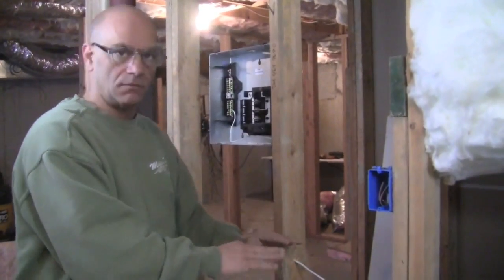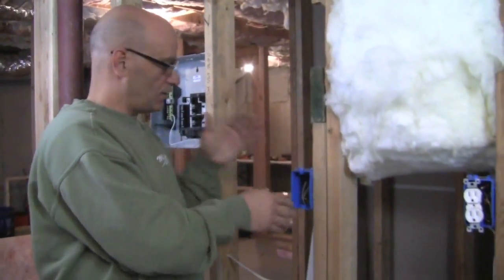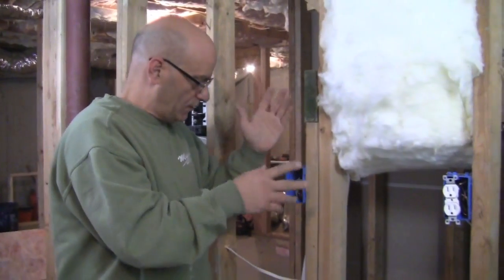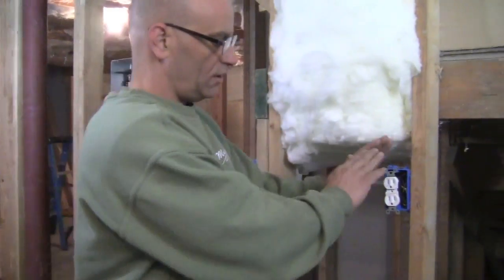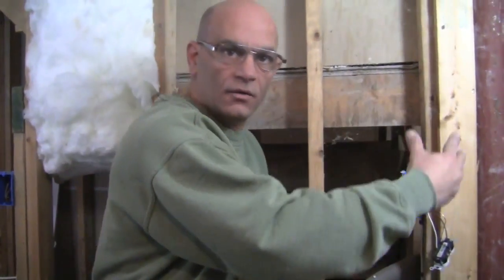So you got power out to your first box here. Again, ours is a foot away. Yours can be 100 feet away. Back out to the outlet, like I just showed you. Then back out to another one, another one, and another one. Up to 10 is a good thing. Now, either it be a 15 amp circuit or a 20 amp circuit, it's still holding true.